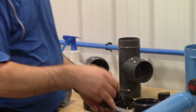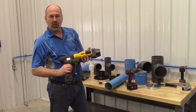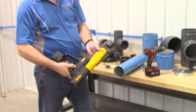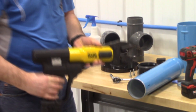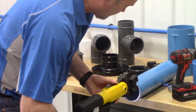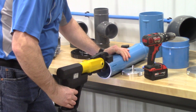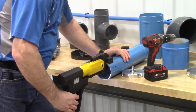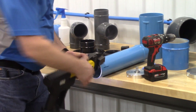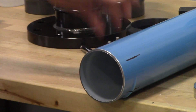Take the lugging tool. There's a forward action, and as it crimps all the way, you'll hear it click and that'll stop. Then push the button on the side — that'll take the pressure off the tool and allow you to open it. The head can swivel, so take the tool, line it up to your marks, and make the lug. There's a little release button on the side you push to release the tool. Take it off — there's your lug. You're going to do five lugs around the entire pipe, and then we're going to go to assembling the fitting.